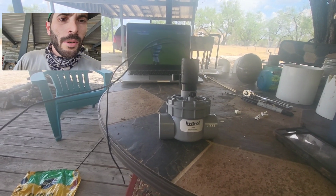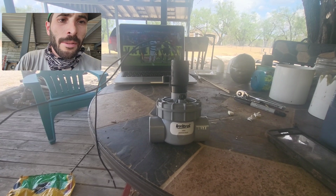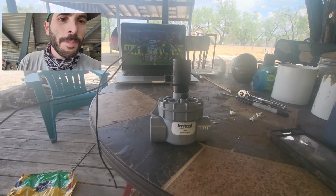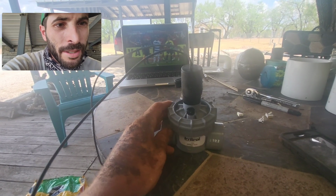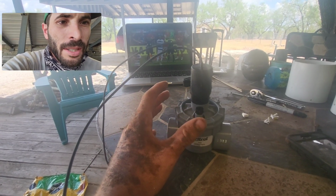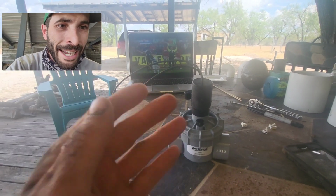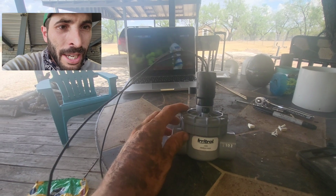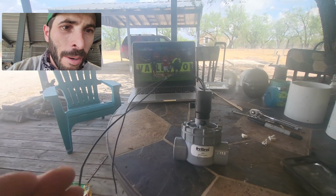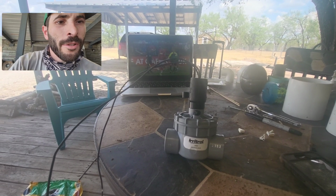So this is a video on jar top valves and how to rebuild them the quickest possible way. Now, these valves are meant to be super easy to service. However, sometimes when they're installed, they're not installed in a way that you can actually access them, or dirt has fallen into them. So the only way that you can actually get this guy open is by digging up the whole valve box and then using channel locks to unthread it.